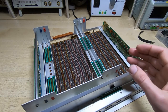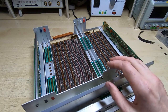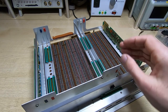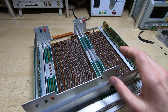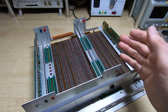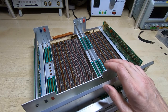It was very intermittent. One thing to bear in mind: these machines work on more digits than they display to avoid rounding errors. What I ended up doing was taking the boards out as a complete assembly, powering them up, and although you can't see the display, you can hook up a logic analyzer and do some fairly in-depth testing. Be aware that these machines use minus voltages for their logic — basically zero, minus fifteen, zero, and minus eight volts — so you need to make sure your logic analyzer can handle that, otherwise you'll blow up the calculator or your logic analyzer.